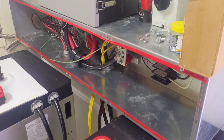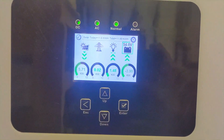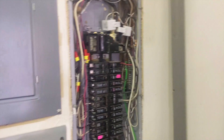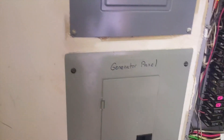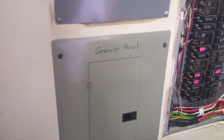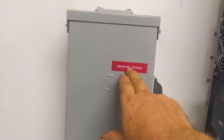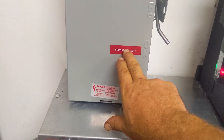Day three wrap-up: batteries are back in place, tidying things up and ready to put the gutter cover on. We've got the system programmed with the right settings with the CT, so we're not exporting but we are offsetting. This was a generator panel and a backup panel — we have made them both backup panels. We've put in our traditional bypass, which can be either grid or generator, and that's the normal operation. Monitoring is set up.